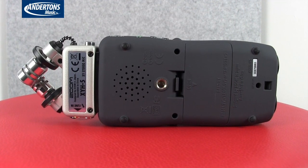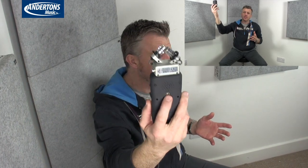Overall I found this device very easy to use. You can mount it via the mounting hole on the back on a standard camera tripod or hot shoe. The display is nice and bright with a good amount of information on there. You scroll through all your recording formats within the menu, so you can't really change them on the fly — it's not quite as versatile as some others where you can just flick a button to toggle through recording formats. You have to go into the menu, select your recording option, select your format, confirm it and come out.